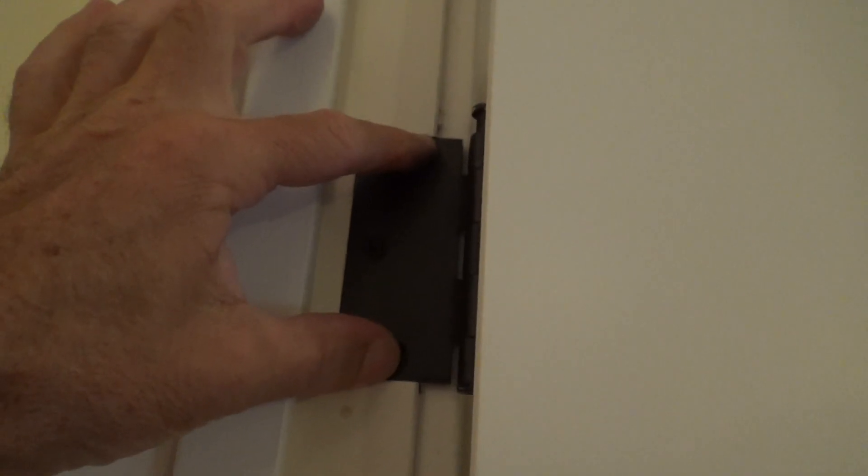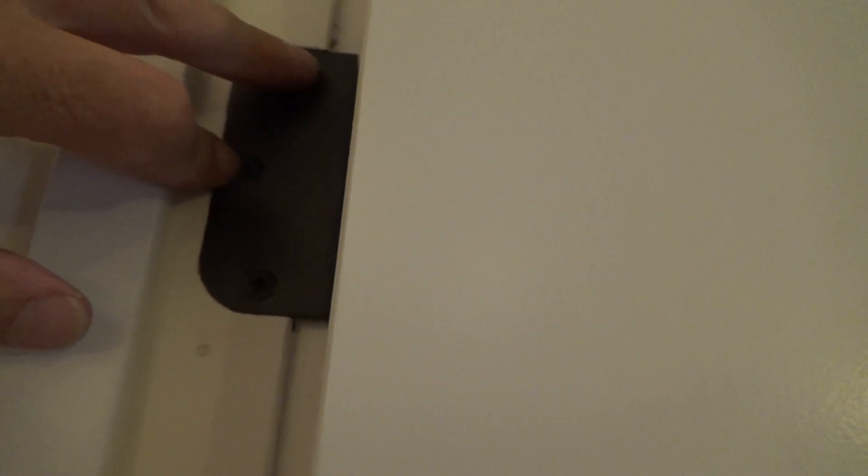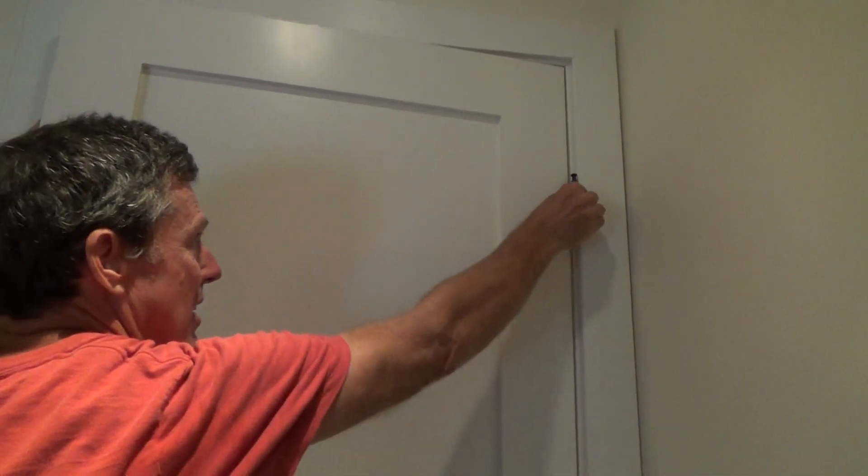But just by sucking up the rest of that hinge — remember, the middle hinge screw was tight before. You might think that's good enough, but the only screw that was tight was that one. And that was keeping the rest of this slightly moving because you were only attaching the whole hinge right there. So this side was lifted out. Those new screws sucked that up tight, and that screw over there kind of pushed that tight and did it well. I checked these two screws on the backside — they look tight anyways. I even push on here — I don't have any flex now right there. Nothing at all. And that's what I want.